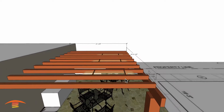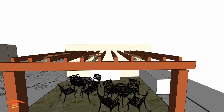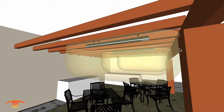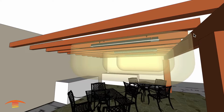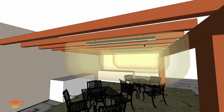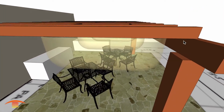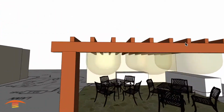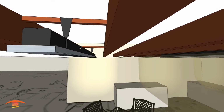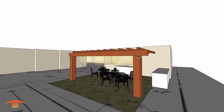And on this application, I moved these beams over already so we wouldn't have to go through all that. Now our dimensions are proper for the clearances, and you can see the lower clearance here. What I've done is taken the heater, this edge starting point here, and moved it out 18 inches. I may have mentioned 16 inches, but it's 18 inches. In any case, 18 inches of clearance is met, so that's not an issue on that side. Everything else is the same as before. Clearances just drop down below this beam slightly. Unless you wanted to move them up for visual purposes, that'd be fine. You want to go just to the top so the elevations are the same like I said before.